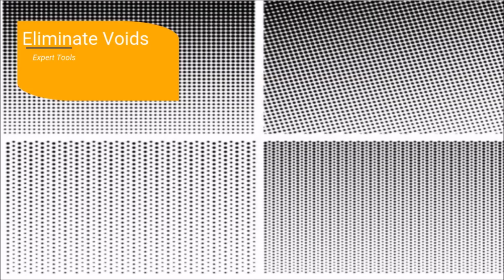CER and United Silicone both have deep expertise in using dies to eliminate voids. CER and United Silicone's dies are improved by our experience and unique manufacturing techniques. Texturing or screening of dies in conjunction with our approach to reliefs, the raised area of a die, can eliminate voids which cause air entrapment and compromise decoration. Our texturing technique eliminates air entrapment inherent to hot stamping large, bold, or solid areas.